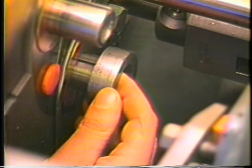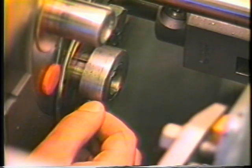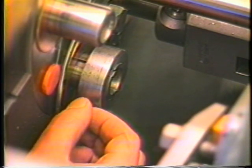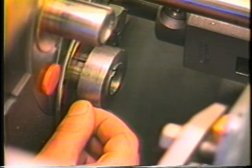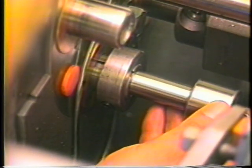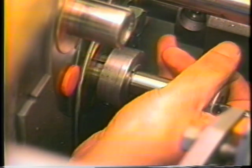The second position drill is installed in the Davenport machine by first placing the 900 collar on the spindle and aligning the set screw in the collar to the hole in the side of the spindle. The set screw is now threaded in far enough to prevent the collar from turning, but not far enough to interfere with the holder which will fit into the spindle.